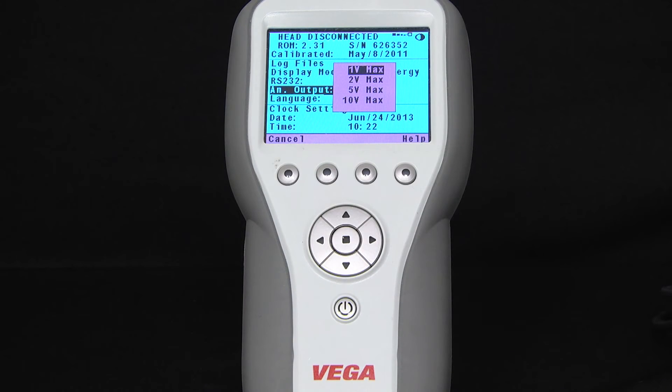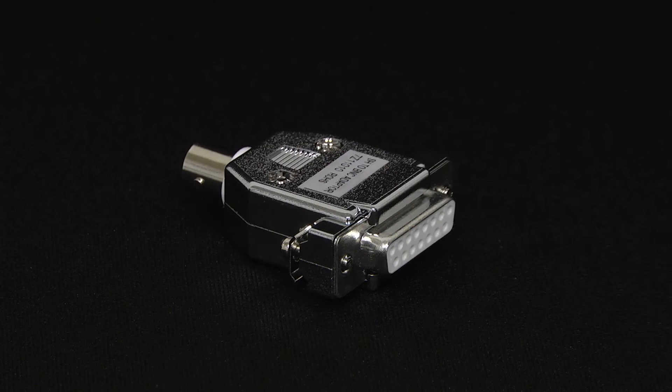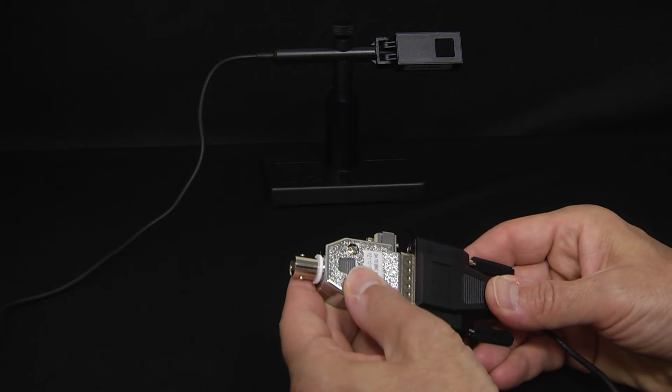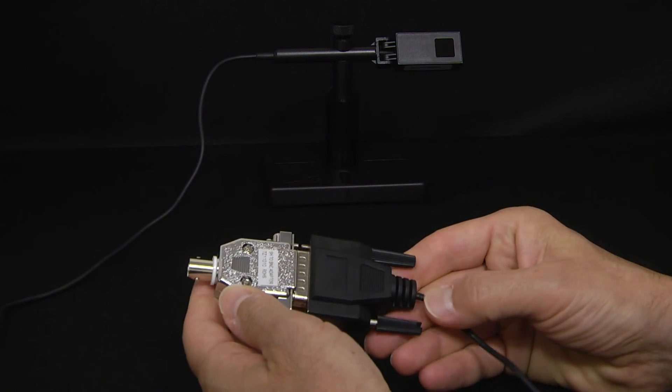The full-scale voltage is a function of the meter being used and the power range that it's on. Two: the SH to BNC connector simply takes the raw output from the detector element and sends it to the scope. It bypasses the calibration data stored in the sensor EEPROM, so it essentially turns the sensor into an uncalibrated, dumb analog sensor.